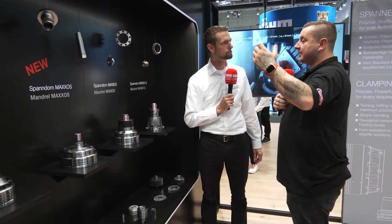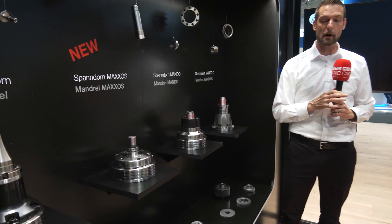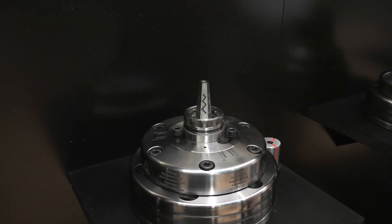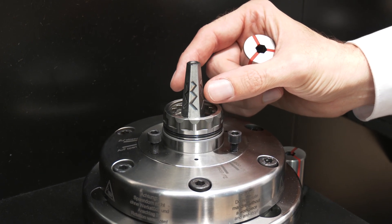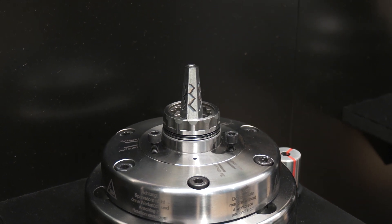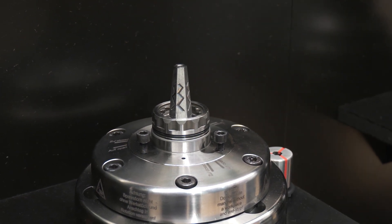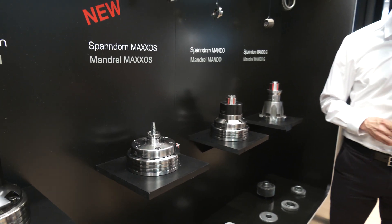So what are some of the advantages of the Maxos? The Maxos is the newer one we came out with a few years ago. Instead of a round taper, it has a hexagon pyramid shape. The advantage is you can handle much higher forces — the surfaces come together and you can grease the grooves and they hold, giving 155% more torque compared to the original round version.